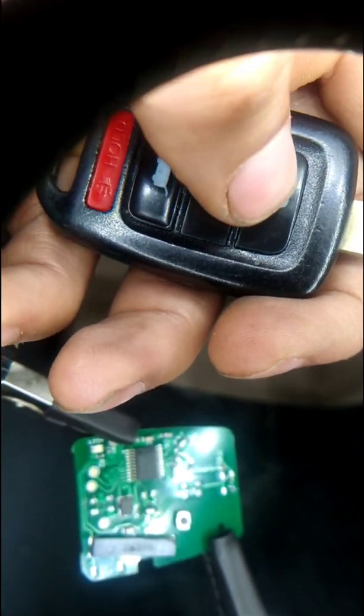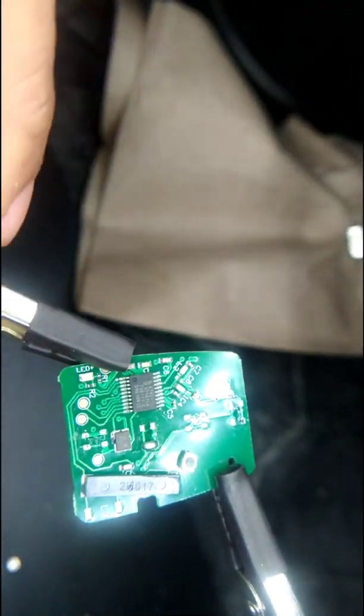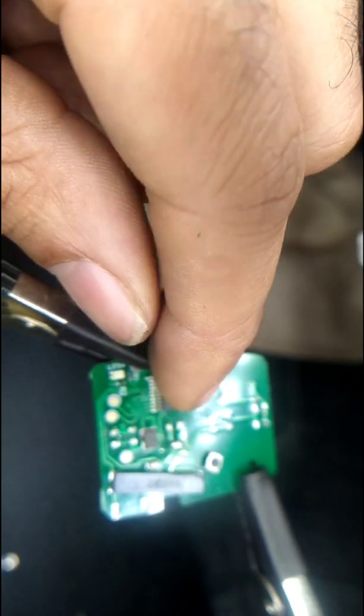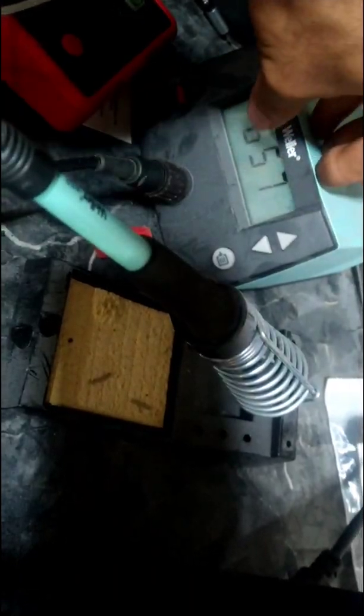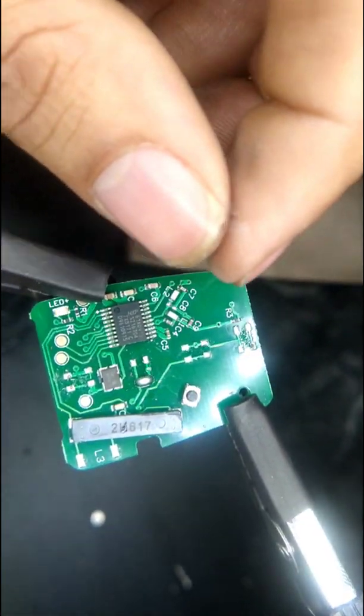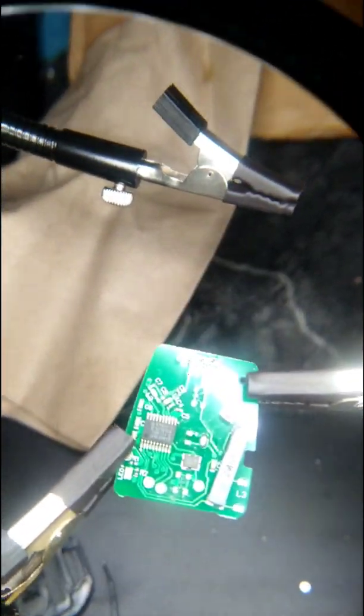You can see it works fine. So I took it. Now this is bad. This is my solder. I just put a little bit of solder here so when I peel it off the joint could be a lot easier. But basically what I did was I just took my welder at 600 degrees. It's in standby mode. In heat up mode it's at 650, 657. So I heat it up, and I put the solder tip on each pin, and I gently pry it off as I'm going.